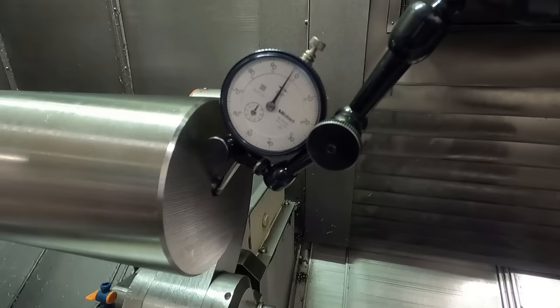So I didn't really have time to do all that video on that end of the part, but here's the other part on the pallet done. I have to ship these parts today, so unfortunately I didn't have time to make the video on that. I'll video taking the part out of the chuck here, so you get an idea. It's just the reverse of putting it in, really, the way you put the strap on and everything, and it'll give you an idea of how this bushing helps you get a part like this in and out of the chuck without scratching up the OD of the part.